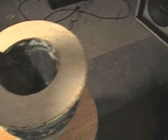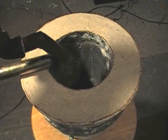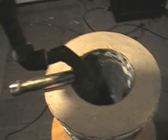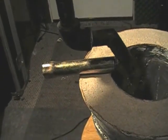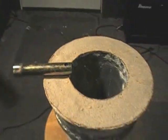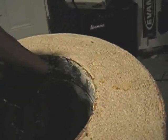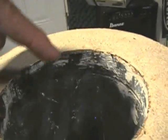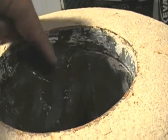Now I'm going to cover the air nozzle here for you guys. My air nozzle normally sets up right about here, and it protrudes 1 inch deep into the fire cone, okay? I'm trying to do this and hold the camera, so I'm not steady, but hopefully you can see what I've got here. I told you guys before that I had a 1 inch flat ring that was welded to the top of the fire cone right here. Well, that's how deep my nozzle goes. It goes right here, and it stops right at the bottom of that flat ring.